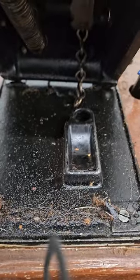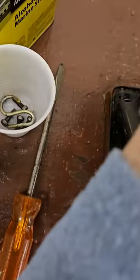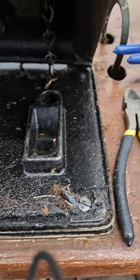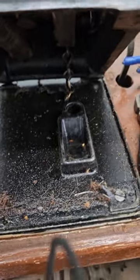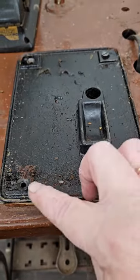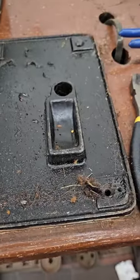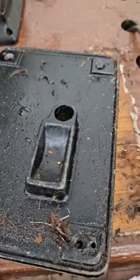The chain dropped down through that hole and was connected with that hook. I've got a cup to save all my parts and now the whole head is free. We'll lift it off and clean underneath this plate. Here we have the bottom plate — I've removed the screws that hold it to the table, this is the last screw going in my cup, and now I'm going to lift this off. It looks like it's been painted around, so that's going to free the plate.